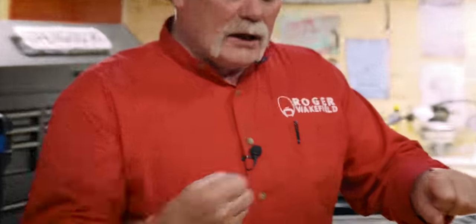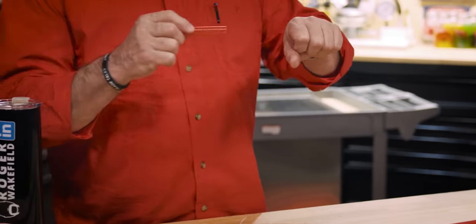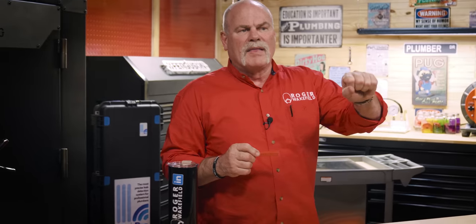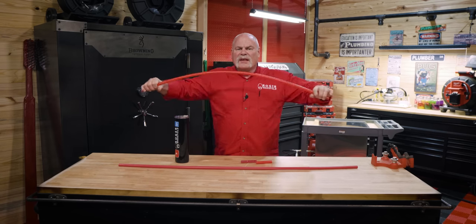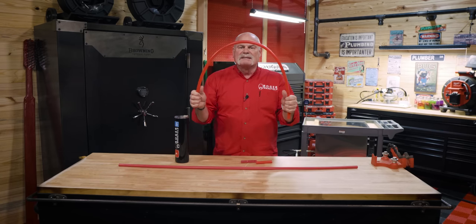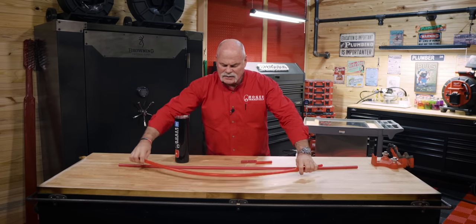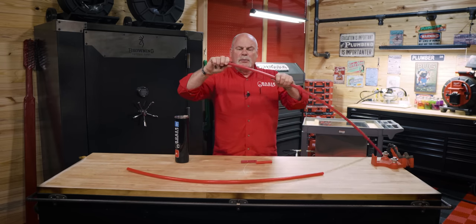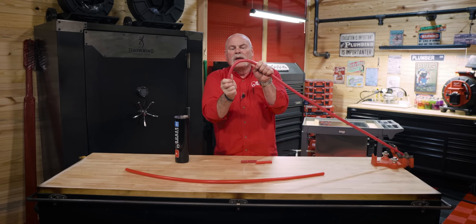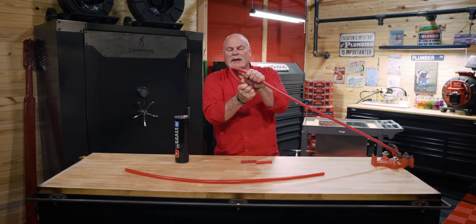You expand it, pull it out, and you've got a few seconds — you stick the fitting inside, and for the rest of the lifetime of that pipe it's trying to reduce down to its normal size. Another thing about PEX-A is it's flexible. You can get tighter radiuses and make better-looking turns, but if you bend it too far, it will actually kink just like that.